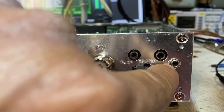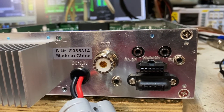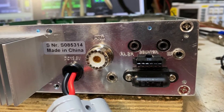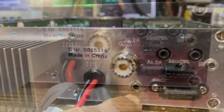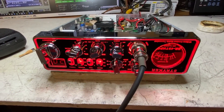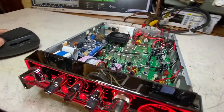Here on the rear panel we've installed our line-in connector right there. We used a 1/8 inch jack due to the space limitation on the 487 and also the RF power factor — a larger 1/4 inch jack connector would be susceptible to a lot of RF interference. The other 1/8 inch jack is for our PTT, for an external foot switch or mouse switch. That's our SR-487 with the ACmod 7.